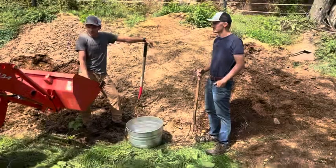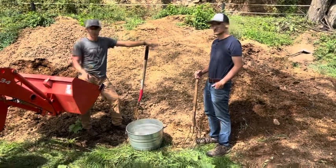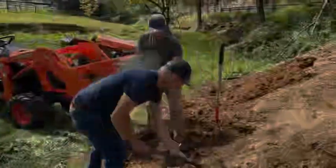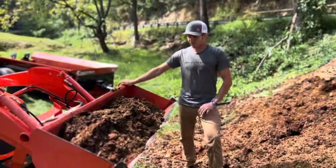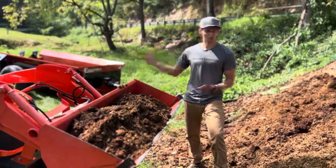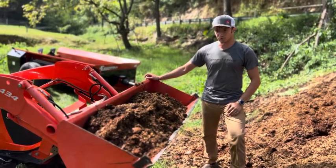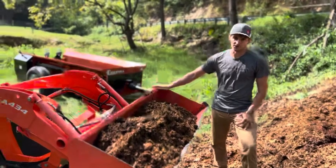One last measurement we're going to do here is how many bushels fit in the bucket of the tractor, and then of course how many buckets fit the spreader — that's important as well. We've got our bushel basket here and we're going to start filling. As you can see, we fit four bushels in here. You can tell I could fit more, but per scoop for the tractor you're probably not going to be able to keep it perfectly. It depends totally on your patience and what you like to do. So four bushels per scoop — let's see how many scoops go into the spreaders.